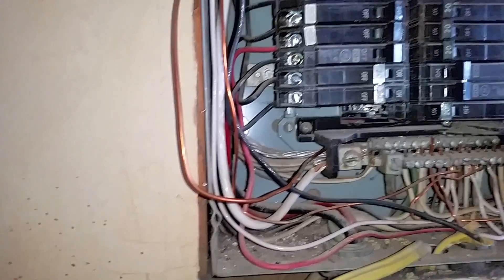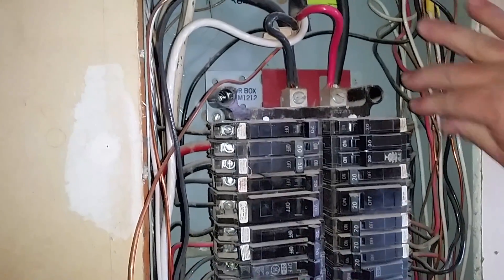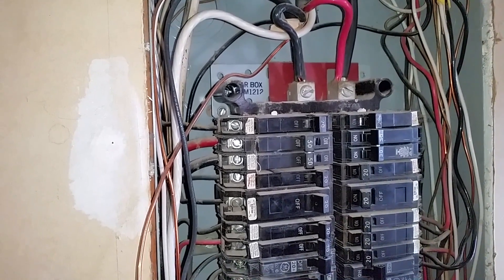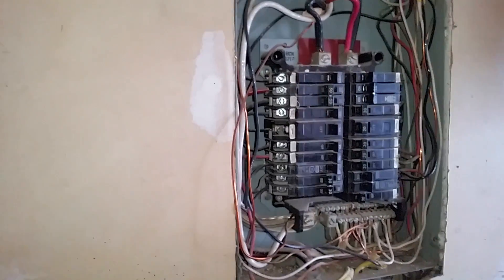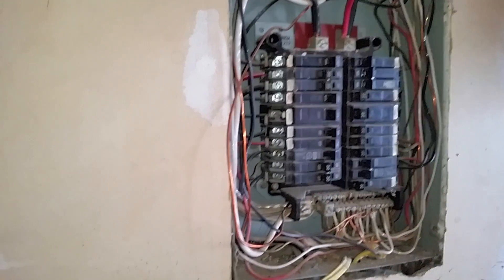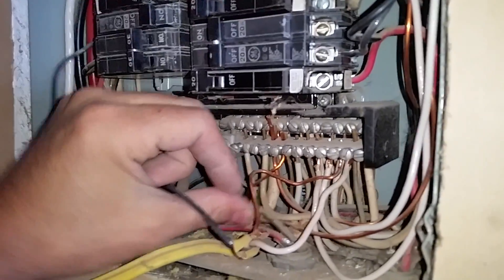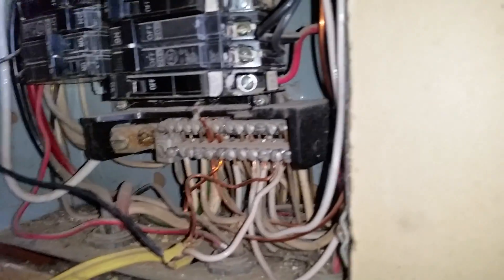Other than that, we're just going to clean up the box and clean up the wiring. The new box will have a lot more room in it. First step, we're going to start tearing all the wires out and label what we can. The panel lid wasn't labeled at all — otherwise we'd label each conductor so we know where it goes and can put it on the new panel.